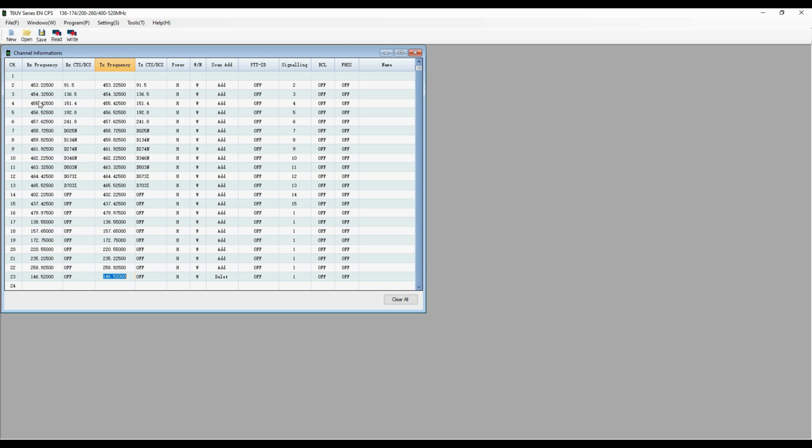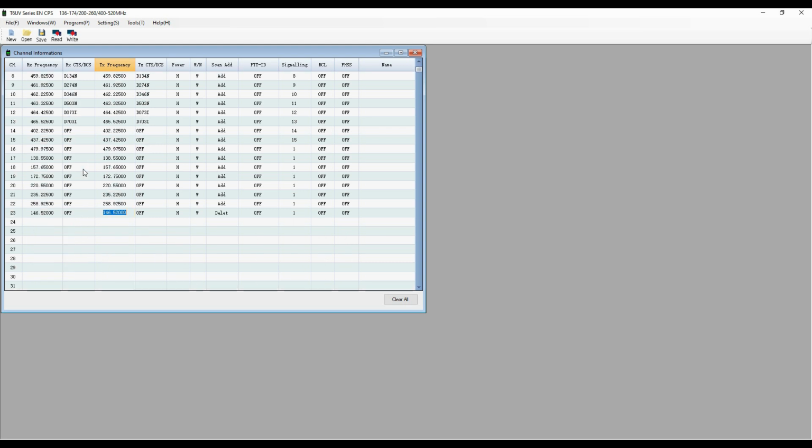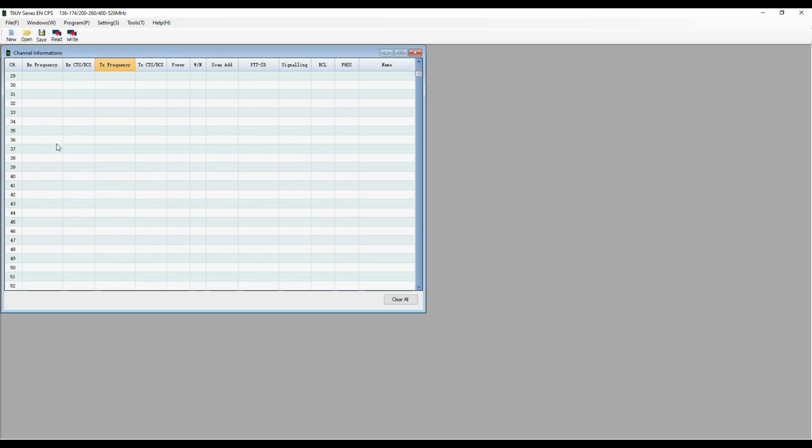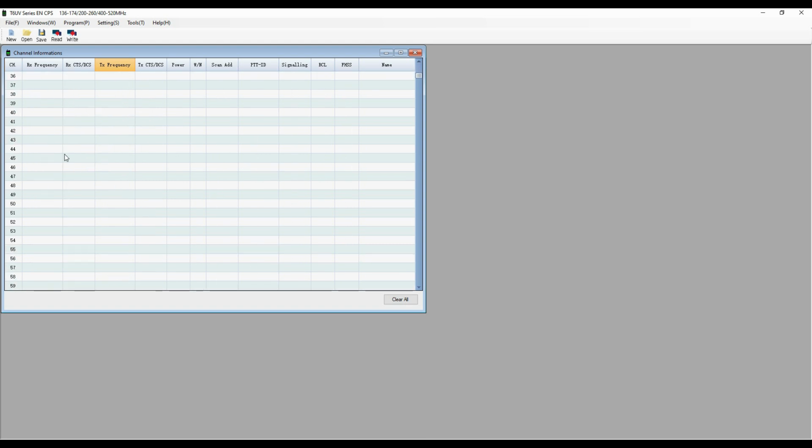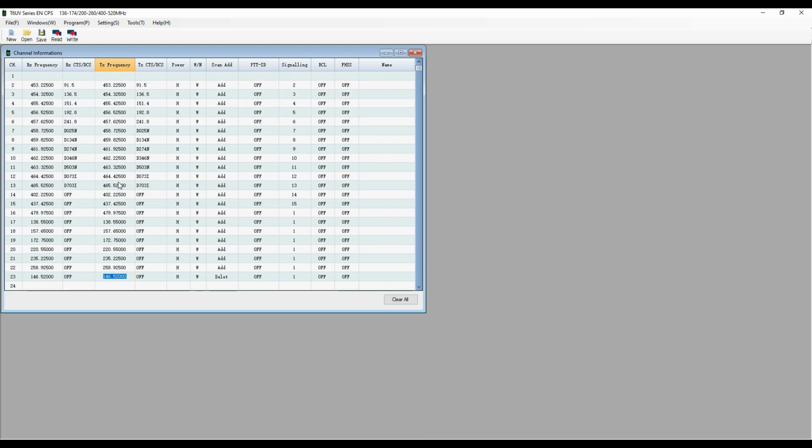So maybe channels 1 to 50 are going to be your locals, and 50 to 100 are going to be a city that you visit. Regardless of what it is, whether it's marine, whether it's GMRS, other bands that you want to monitor, give that some thought before you start programming, because this particular radio is not the easiest one to move around channels here in the CPS, and so you'll save yourself a lot of key strokes when you do that.